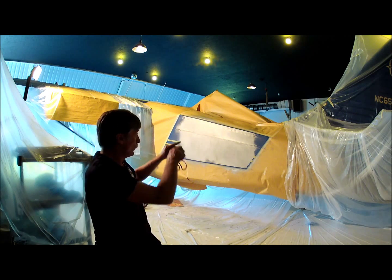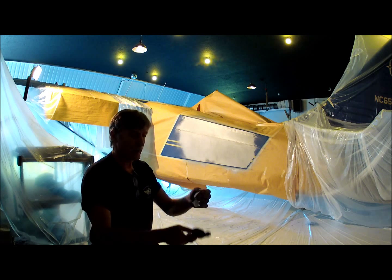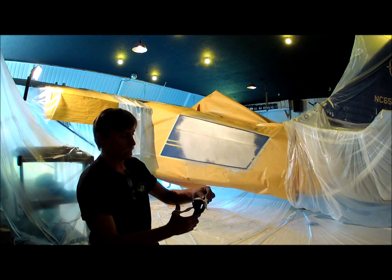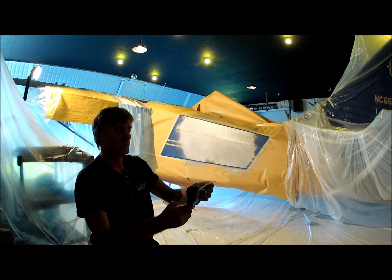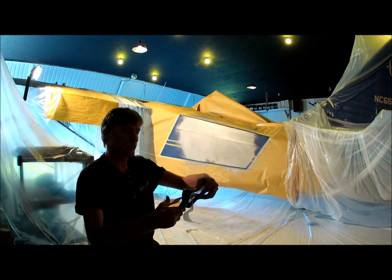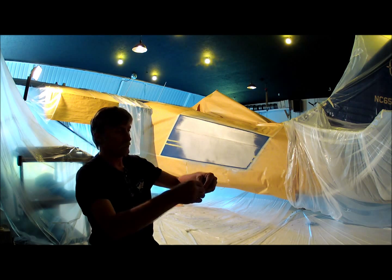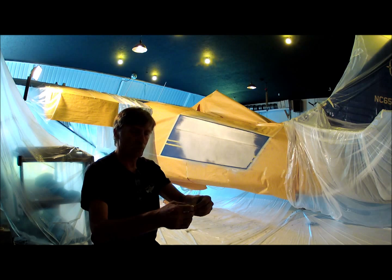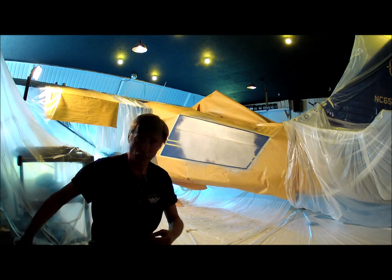Give yourself two inches on either side of the damage area, and then fabricate or repair — make a patch out of the same fabric using original fabric, a pair of pinking shears that really do a nice job. Look at this. Make a nice little pink cut right here. The purpose of the pink is so that the fabric doesn't have a tendency to unravel itself. It will stop when it gets to the next pink.